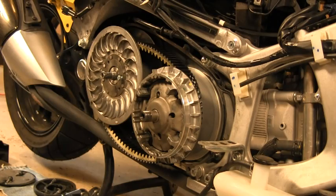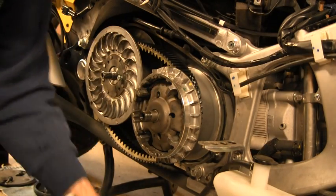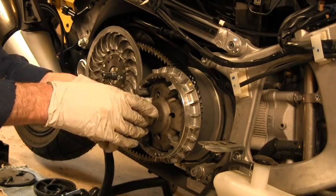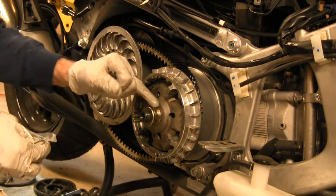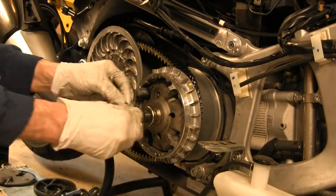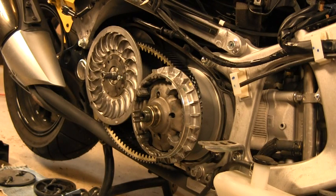This is what they call the spacer. And it goes, where's the nut? Yeah, it goes on the small side. Okay. This one goes back in here, and it shows the O-rings. Let me go ahead and get them out. Well, they're right here. There's two O-rings that go on here. I'll go ahead and put new ones on them. And again, be careful when you're sliding them on that you don't cut them. Supposedly they get a coat of polyurea grease too, as well as the nut.